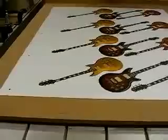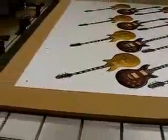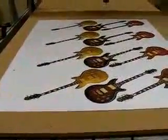To manually align the material and cut out the guitar shapes would be nearly impossible without damaging the print. So with the Tecno Vision System, we can scan these three location dots, then readjust the G-code file and an accurate cut can be achieved.